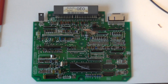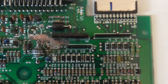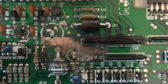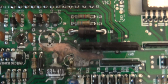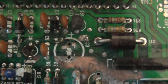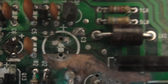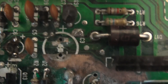This one is a particularly bad one. If I zoom in down onto this part of the circuit board, you can see some bare copper there. That's where I've cleaned up the electrolyte that's leaked out of faulty capacitors, and you can see the footprint of three capacitors there — the large one in the centre of frame. You'll see that the track has completely dissolved away due to the electrolyte leaking, and I'll need to patch that.